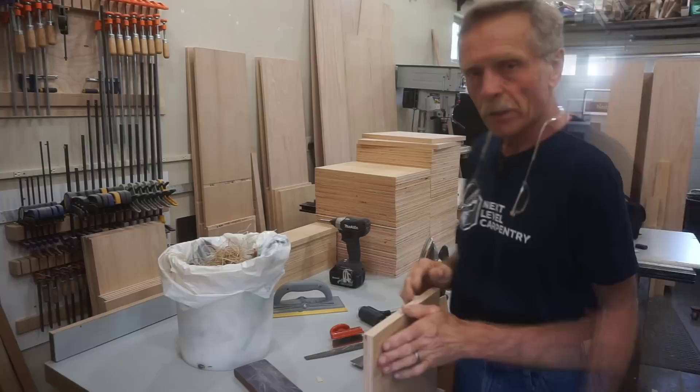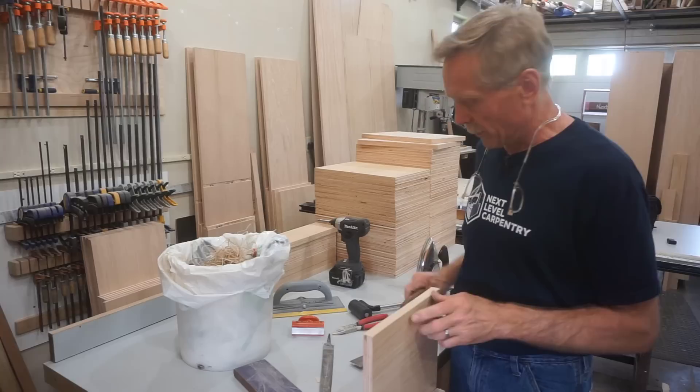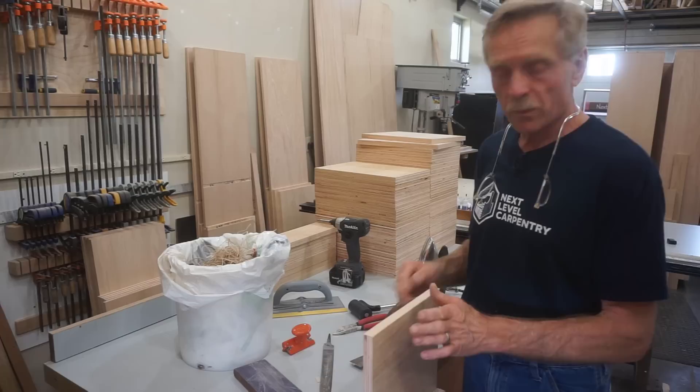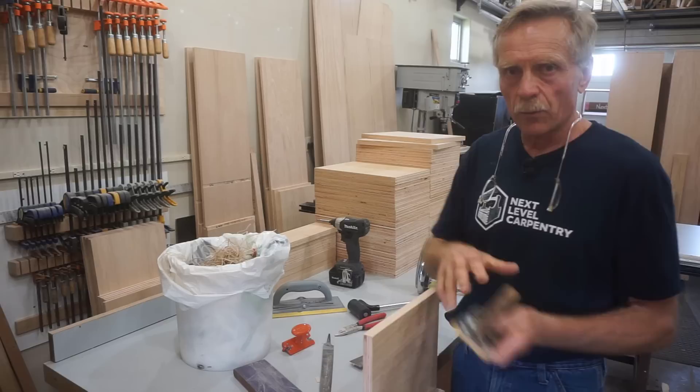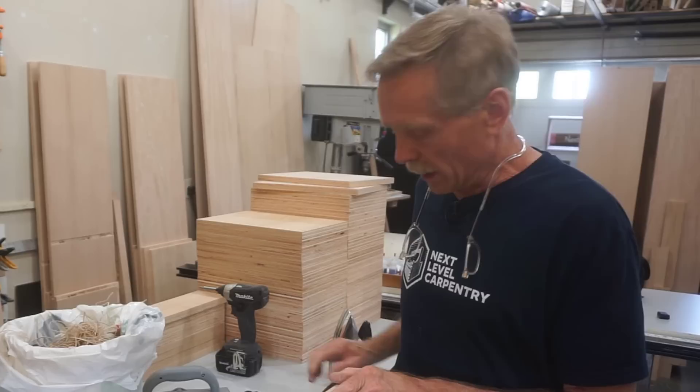When I was going through that sequence, I wanted to highlight the difference between a file for cleaning up the edges and sandpaper. A lot of people use sandpaper after the trimming step, but that edge can be irregular, especially on a splintery wood like oak. By taking sandpaper, it tends to follow the wood and not cut that off — sometimes it over-sands and gets into the veneer, which I don't like. Other times it kind of smears the glue around. So I don't like sandpaper for the cleanup after the trimmer — use a file. It makes a lot of difference and it's a lot faster.